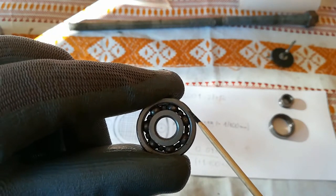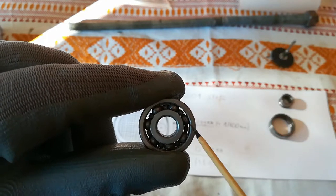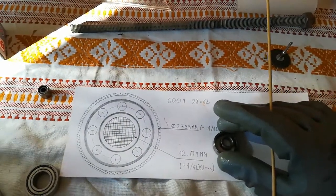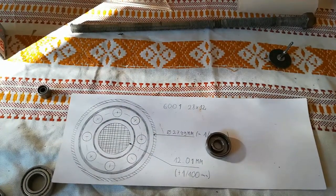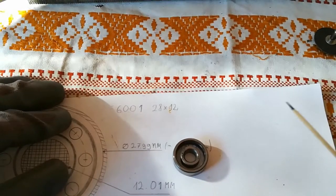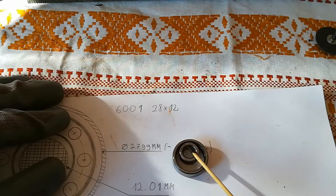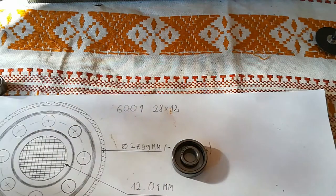To remove the crown, I most of the time just use a sharpened nail and hit it here and it will disassemble. Once we have done this, we are left with the bearings and the balls itself. To remove the races, all you have to do is push all the balls on one side — this is what's going to happen. Now we have this gap through here, which the bearings will just fall out and you will be left with inner and outer race.